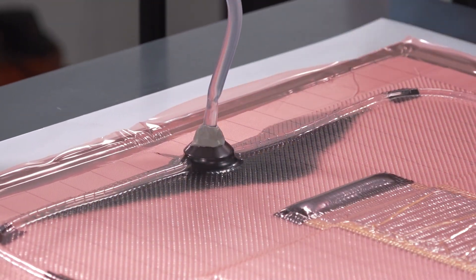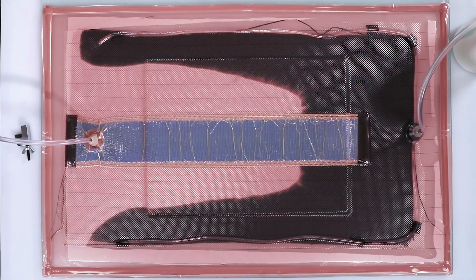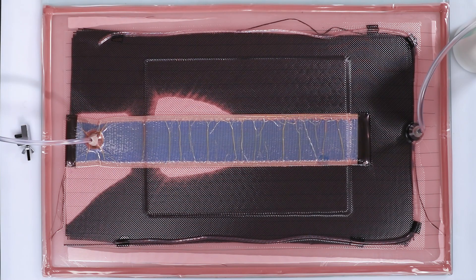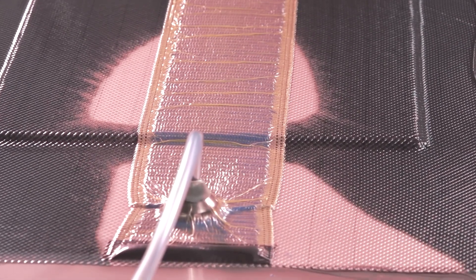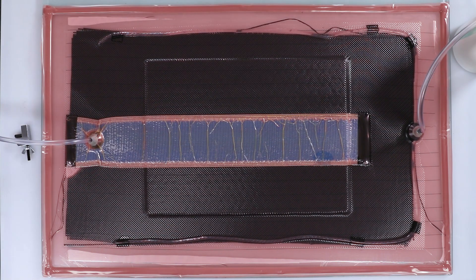The final setup with the core and MVS strip will show the typical resin tracking problem. You will notice that the resin loops entirely around the core, meaning that without the MVS strip, a portion of the centre would be left isolated from the vacuum. On a small part like this you would probably get away with it, but certainly on larger cores you would expect dry areas or pinholes caused by this effect. Resin tracking like this can also occur on complex geometries and laminates that have a large variation in thickness.